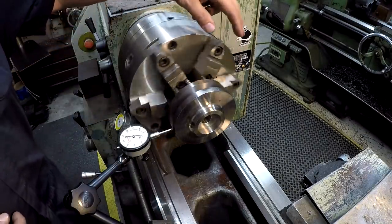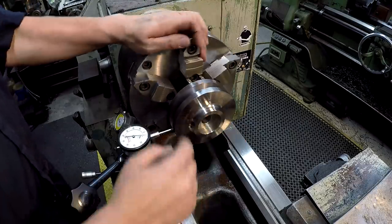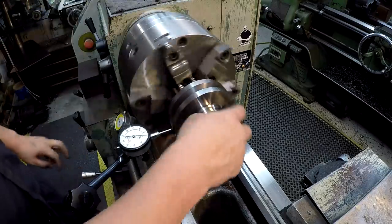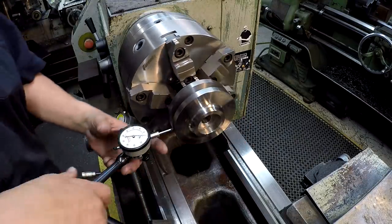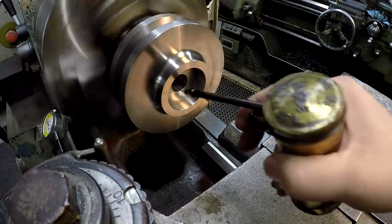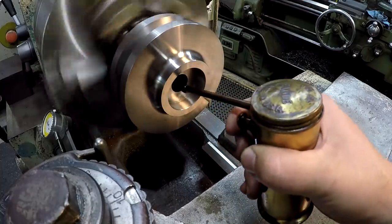But for what we're doing, we're just drilling a hole. It doesn't have to match our bearing fit or anything out here. So we're going to run with that one just like it is, being 1/1000th out on the OD. But that's really good for a scroll chuck. I love it. All right, we're ready to cut our hole bigger. Put a little dark cutting oil in there.